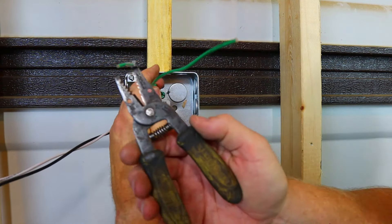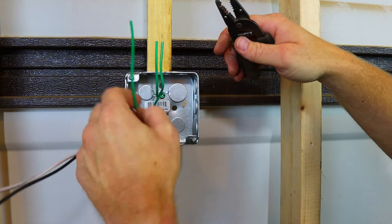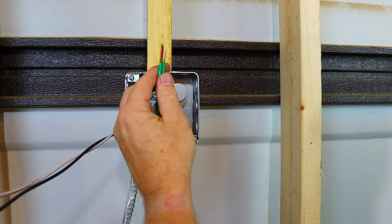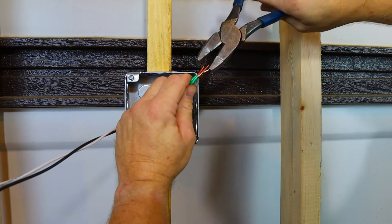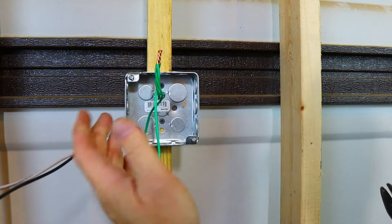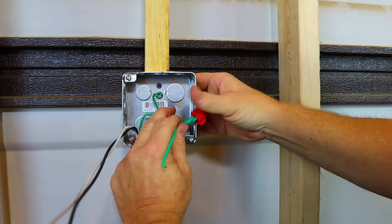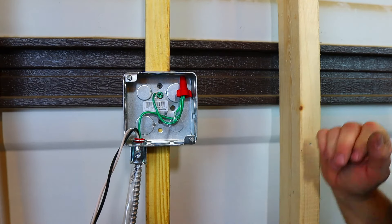What I love about these dual strippers is I can strip two wires at a time. Cut and strip the wire, then take the pigtail wire and twist them together — always twist the wires first, do not just put the wire nut on and let the wires twist themselves. Make sure you twist properly, then put the wire nut on. And there you are — that is the correct way to bond a box.